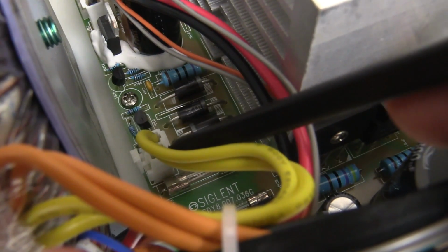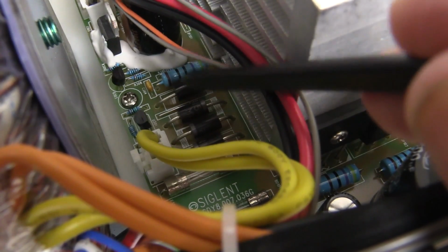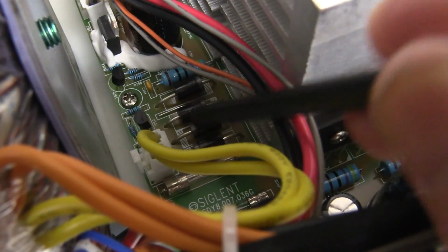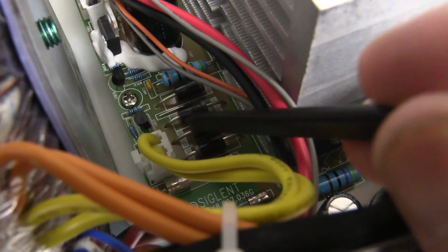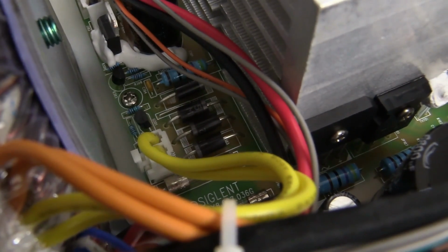so it's a bit dodgy on some of the camera angles here. Anyway, this tap on the transformer, the yellow wires, that's clearly the tap for the 3rd channel output, and there's our full wave bridge rectifier for it. It uses individual diodes for that 3rd channel. So they're not putting those on the heatsink because that doesn't have the same power output requirement as channels 1 and 2. So no problems there. They can get away with that fine and dandy.